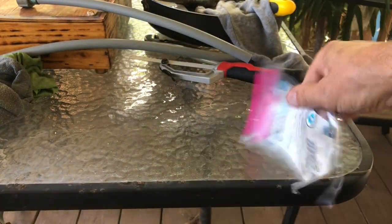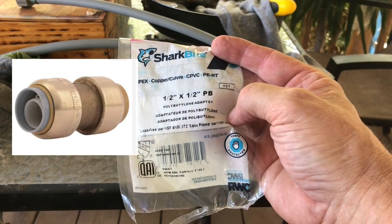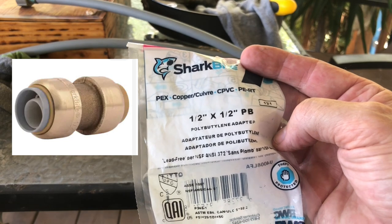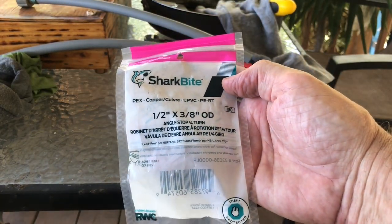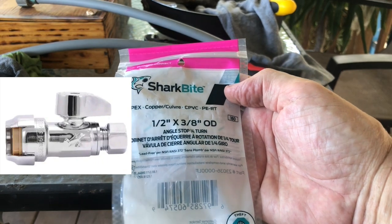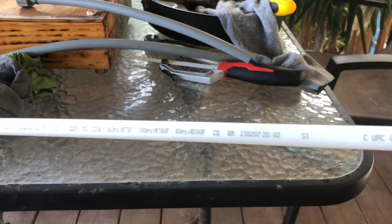Here's the things I bought, guys. This is your half-inch to half-inch PB — that's polybutylene — so that's going to do the transition for you. It's called a polybutylene adapter, half-inch by half-inch. That's the one that allows you to go from your old mobile home polybutylene line to your PEX. And this is just your angle stop, quarter-turn, half-inch — and then the three-eighths is the faucet fixture size; the line coming from the faucet goes to that. And then this here I bought was just a five-foot section of PEX — SharkBite, half-inch.